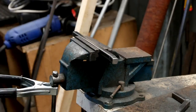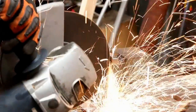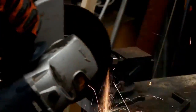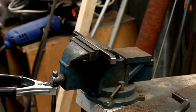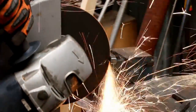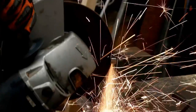What I need to do here is cut it with this disc three times. It's a relatively thin disc so I need to cut it three times. If you're using a thicker cutting disc, you could probably get away with two cuts and then bending. So once you've made the cuts, bend the rod in, make sure the rods are touching and then just cut through the bar again in exactly the same place. This just widens the cut again.